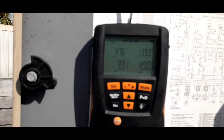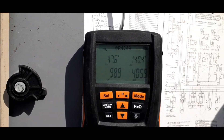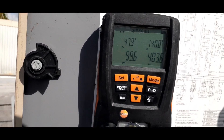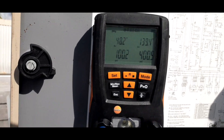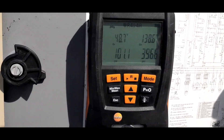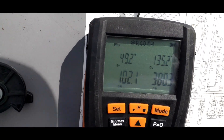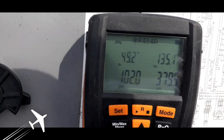Maybe it's a TXV — look at that, 390, 400, this thing is going up. Maybe somebody put extra gas in it, or maybe it's a bad TXV. Let's check the second stage. The pressure's starting to drop again on the high side — let's check the other stage.